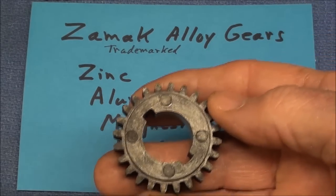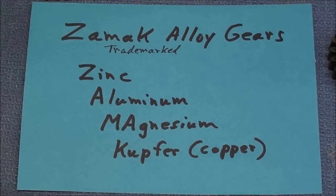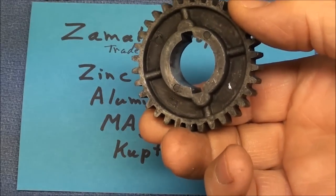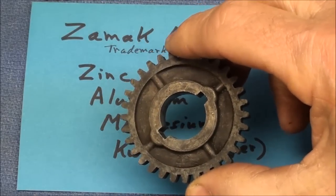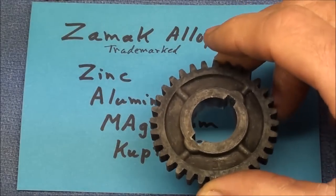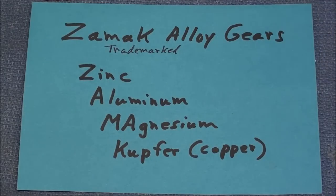You may have some gears or parts on your lathe that look decayed and deteriorated. From what my reading and studying tells me, they used some zinc that was not pure. The good gears were made out of 99.5% pure zinc made by the New Jersey Zinc Company. Zinc is sacrificial, so I think when you see some of that decay, we've got that sacrificial business going on. Enough about what these are made of — they seem to be pretty tough; I haven't ever stripped any.